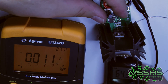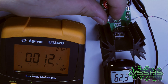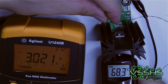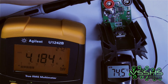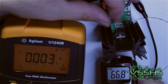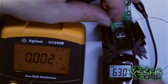Just to confirm it was really the temperature and not some cabling issue, I tried again while monitoring all the wires. This time I set it to a bit larger current — around 4.2A — and as soon as it reached about 78 degrees, it cut out. To get it back running you either disconnect the load from the Reload, or you can wait for it to cool a little and it recovers.